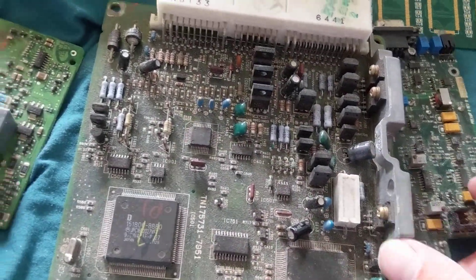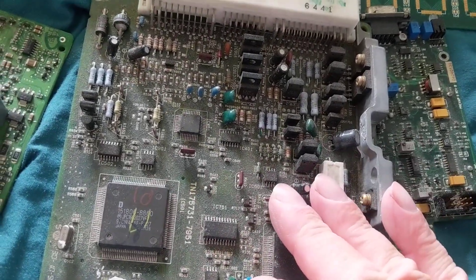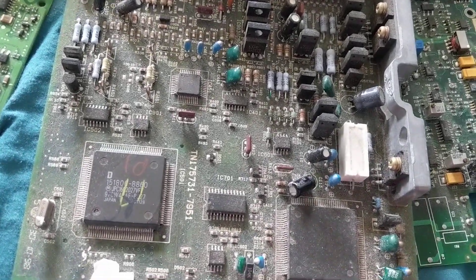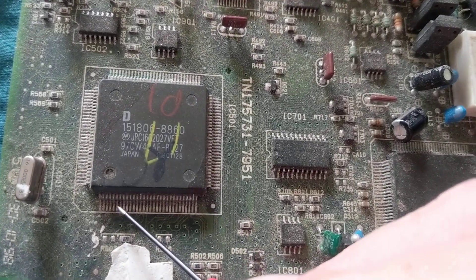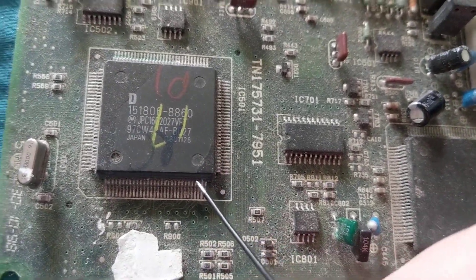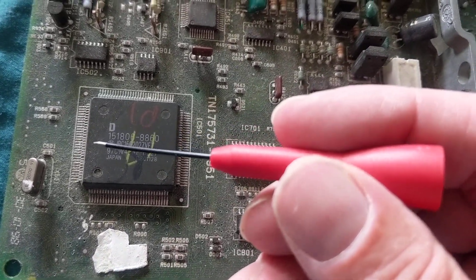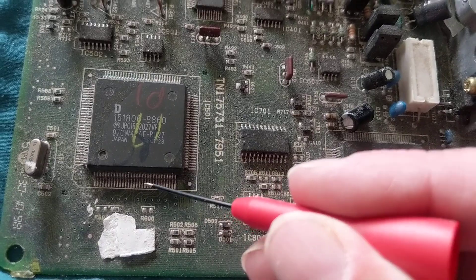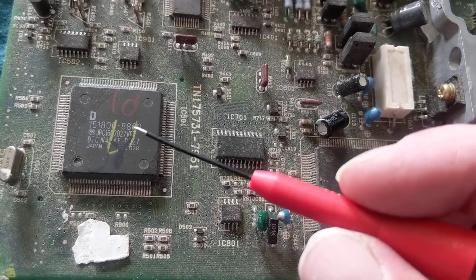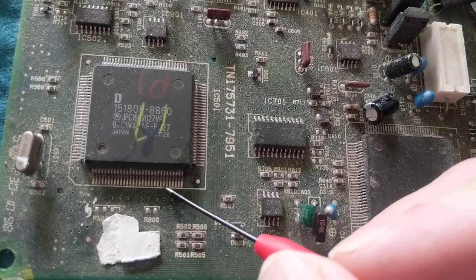As components get smaller, the challenge in automotive is not just heat-related problems but also vibration. These are the pins right here, there are pads over here. This is the probe I use on a Fluke meter to measure pins — the point is very small. This is the one I use so I don't short out two pins together.